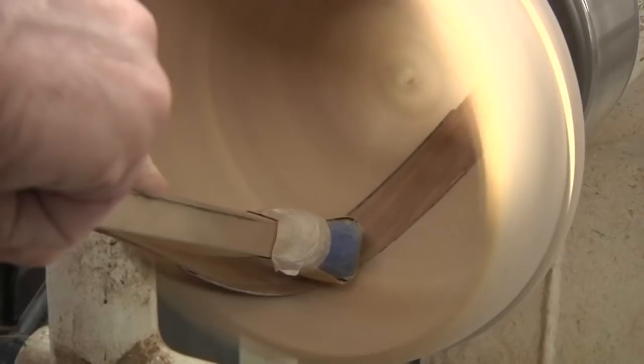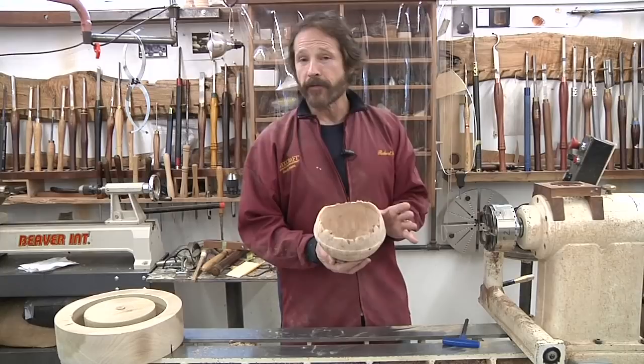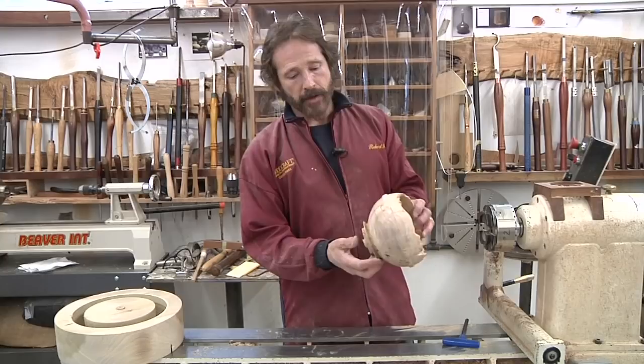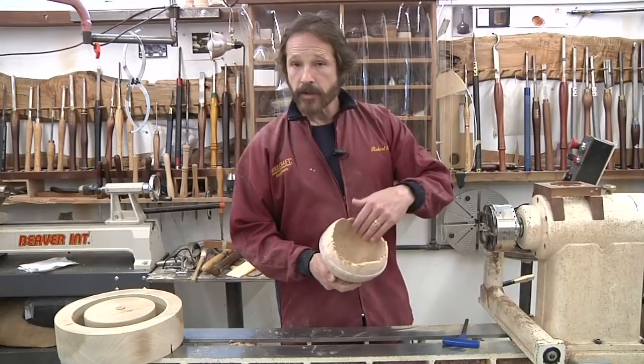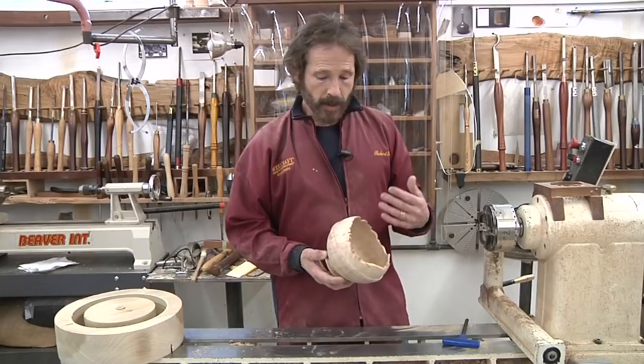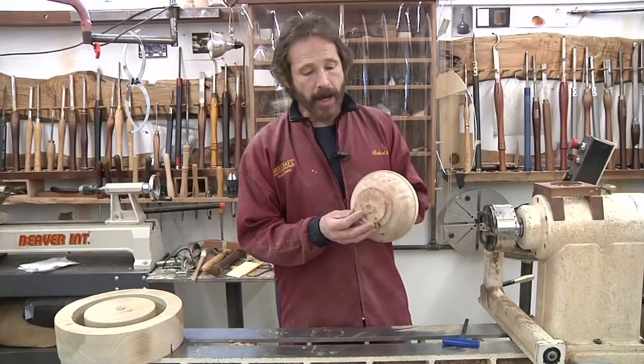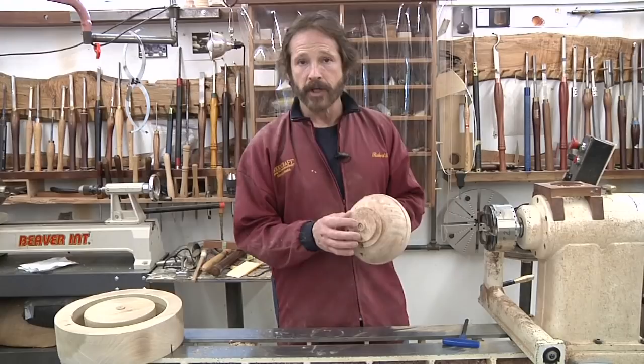At this point I'm not finished — I've got some more sanding to do and I'm kind of out of time. I want to give you a general idea of how this thing would go together and how we would finish off the bottom. The procedure I would follow is to finish sanding the inside — I generally like to sand the entire piece to 320 and then go to a hand-rubbed oil finish, essentially a thinned-down wiping varnish. I tend to do my finishes off the lathe. In terms of turning the bottom, I'd reverse mount it to get access and turn it.